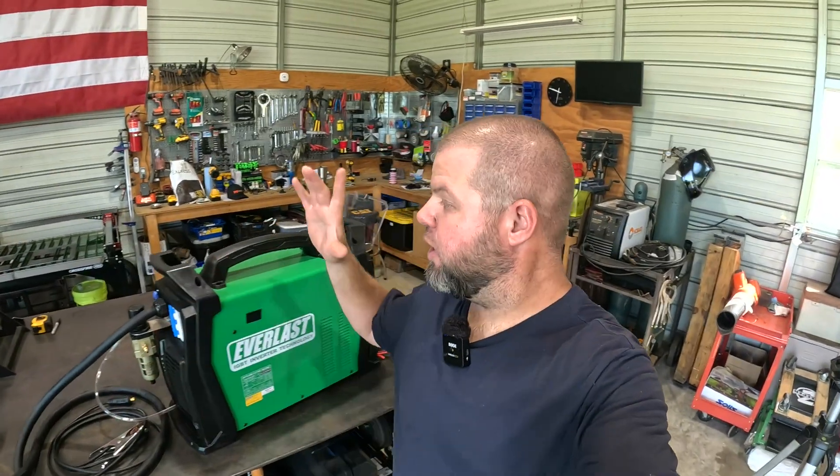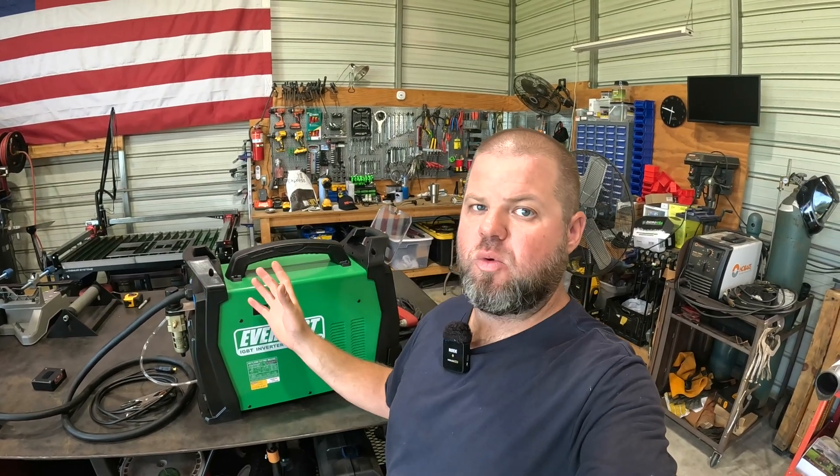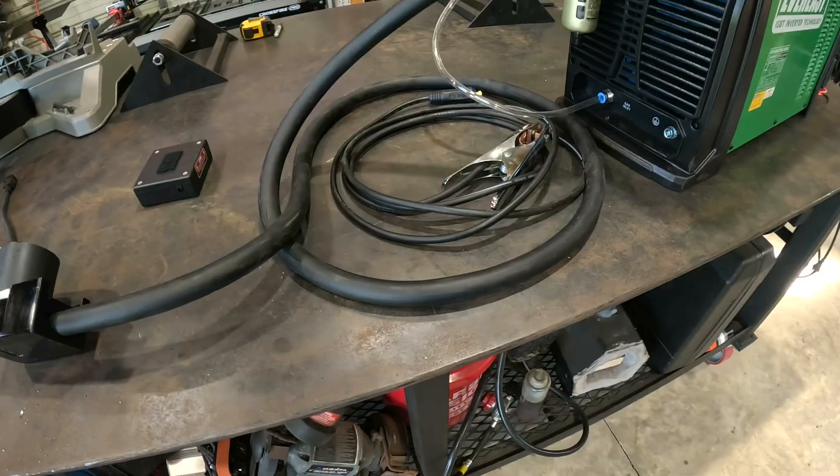It's worth noting that if you go with a massive machine like this, you're going to need up to 9 CFM from your compressor. My 240-volt shop compressor can provide over 11 CFM at 90 PSI. Otherwise, look at the 62i or the 82i — they have less requirements not only for input power but for air if you're running smaller compressors or have lower powered service. I've got a 200 amp service out here, so I'm good to go any way I want to wire this.